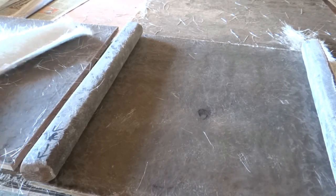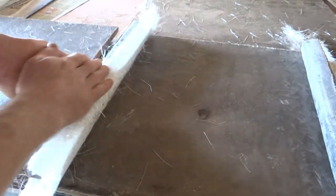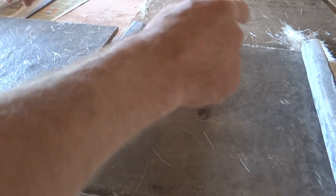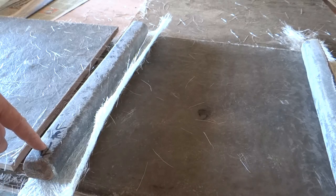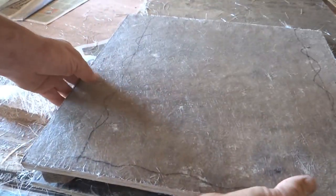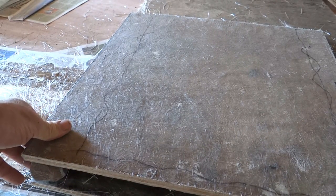What I'll do is put some glass down, wet it out, hold it over, then make up the sandwich. I think I'll just glue it together to start with, put the lid on and then weigh it down with something until the resin sets, and then come over and screw it down. I need to pre-drill these holes to get stainless screws in because it's right hard. It's actually probably a little on the heavy side, overkill but — yeah, pretty good. Solid.